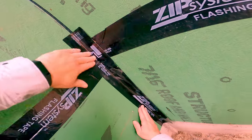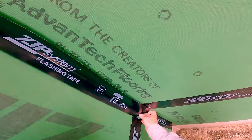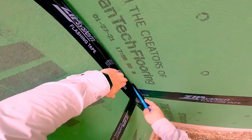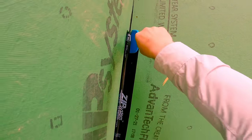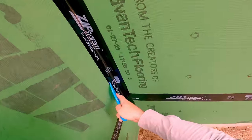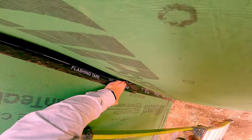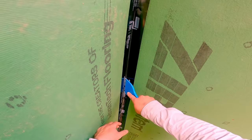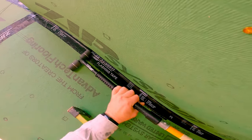Outside corners are pretty straightforward. Inside corners, however, it's best to start from the bottom and work to the top. I like to cut about three-foot pieces. I slightly bend the corner in with my fingers at the top and bottom, then press into the corner for a nice straight line. I have a little quick-flash tool that makes quick work of smoothing out the opposite side while still leaving me with a nice 90-degree corner. Then I do the same process all the way up. This method produces the most consistency and looks the best. When you do this, make sure that as you shingle the tape you have at least a three-inch minimum overlap. Roll that tape.